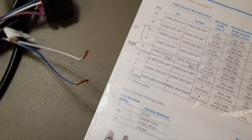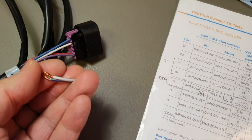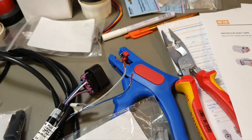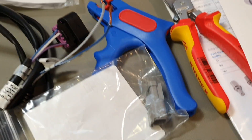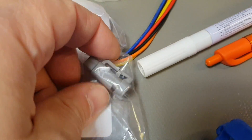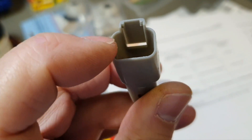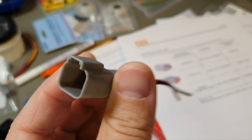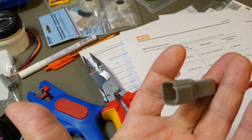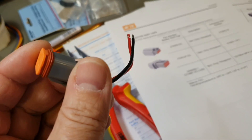Because I bought so much stuff to test DTM, I will do this together with you and use DTM anyway. First we need to decide what is called the receptacle - which side goes where - and where goes what is called the plug. The rule is that the receptacle in Deutsch connectors has open contacts that you can touch, so you should use the receptacle on the side that is not energized when the connection is open. On the plug side you cannot touch the contacts, so use the plug on the side where you have voltage on the contacts when they are disconnected.